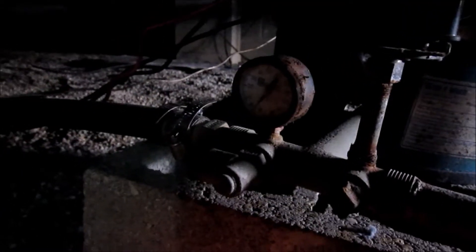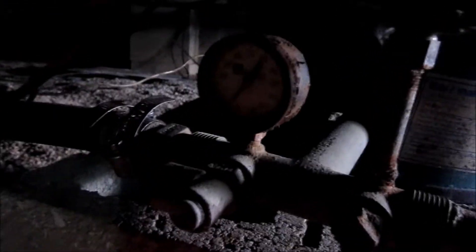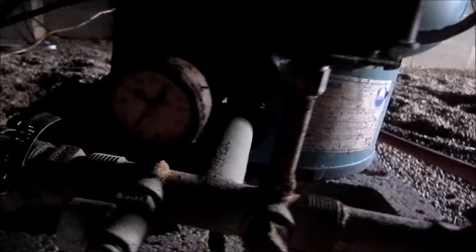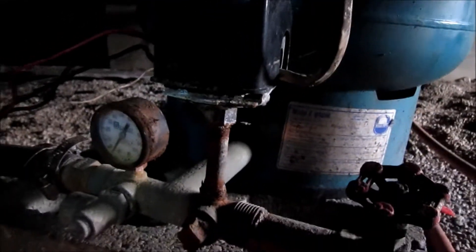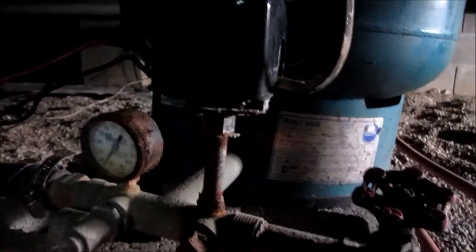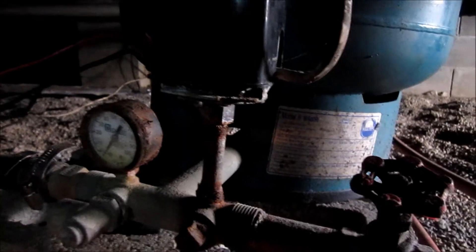Under the home, initiated the water test with five gallons per minute. The pressure tank gauge is reading zero. It was not moved. The activation switch is triggered a couple times, but no movement from the gauge is happening. It seems to just go straight through and up.